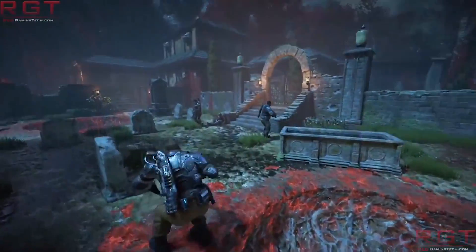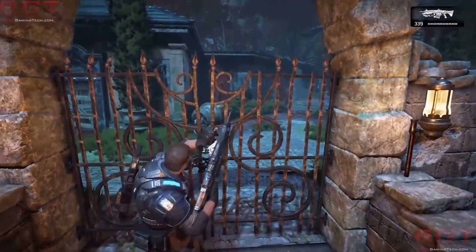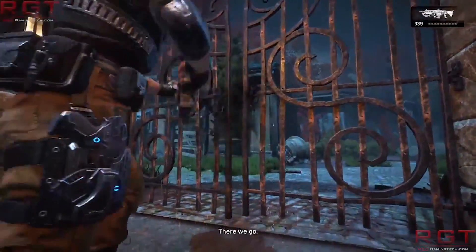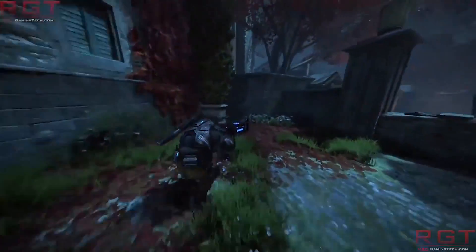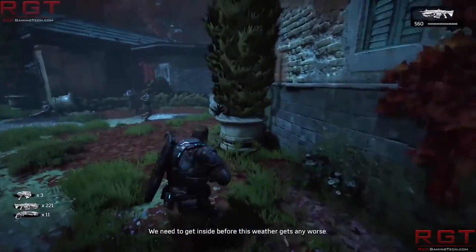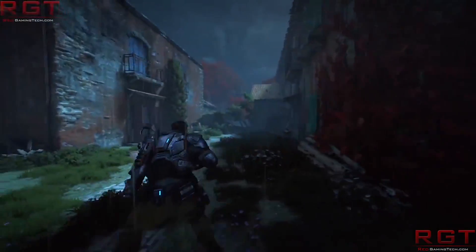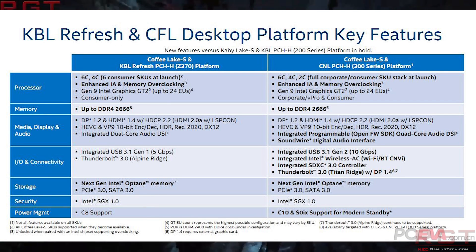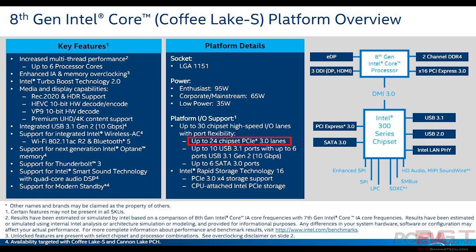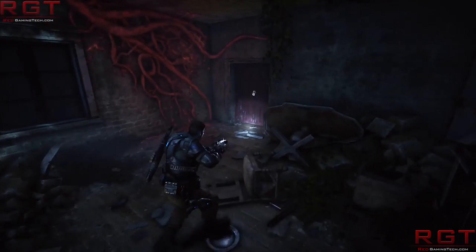Because yes, you are naturally still going to have the odd chip which is damaged. It might just be that someone drops it during production, or more likely you're going to have defects on the smaller chips. But because they are just the smaller chips, they cost less money to produce. There is another benefit: it allows the CPU to be produced with different components on different process nodes. For example, the CPU core might be shrunk down to 10nm while the graphics core is still on a 14nm process — no problem, you can simply slot those together.